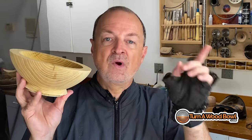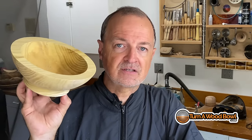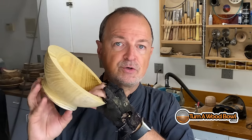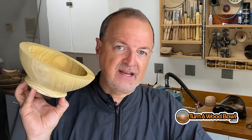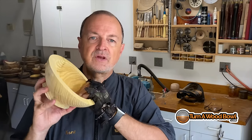You also have to remember that every different tree species is going to react differently, plus when the tree was cut and how much moisture was in it. This particular piece was cut several months ago and I recently cut it into logs, split the log, and made the bowl blank. There's still plenty of moisture in here — I've had logs kept on hand for over four years that still had plenty of moisture. So it depends on the species, the moisture, your environment, a lot of different things. Essentially, what we're going to do is speed up the drying process, and that is the whole purpose of using the microwave.